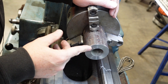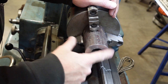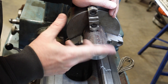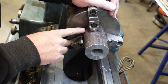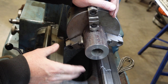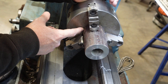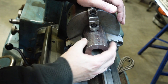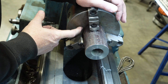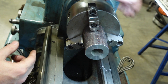I'm starting out by facing off the end, easing in some chamfers - I've also put a slight chamfer there just to break the edge so I don't cut myself. As a tip: I haven't got the material hard against the chuck face. The reason for that is that sometimes, particularly when you have a piece of material that's saw-cut on both ends, they could both be crooked. So what I tend to do is space it out just two or three millimeters so the three-jaw is centering the material, and I can then flip it round and put that faced end against the chuck face knowing it's going to be flat.